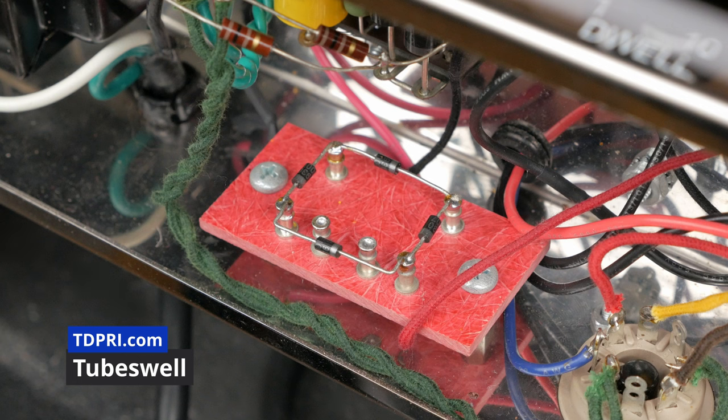You can buy insulators for the phone jacks, but you'll need to purchase special isolated RCA jacks for that part of the job. The insulators and the special RCA jacks didn't fit in the pre-drilled holes on my chassis, so I had to drill them out to be slightly larger. For this, you'll need drill bits designed to drill through stainless steel. You'll also want to make sure you provide resistance on the inside of the chassis before you drill.